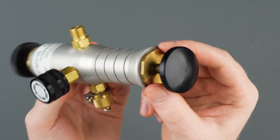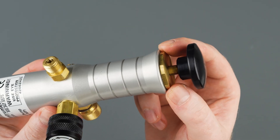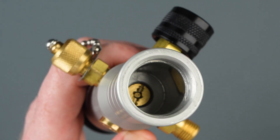If we have to replace our internal check valve, the process is very similar; however, we'll have to remove the pumping piston first. To remove the pumping piston, we'll need an inch and a quarter wrench to remove the piston. Now we can see there's an internal check valve inside the pump.